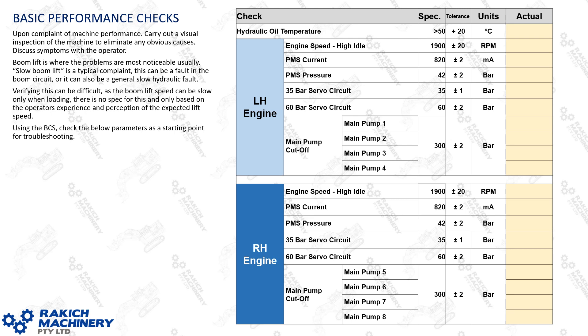After that, have a visual inspection of the machine — make sure nothing's obviously damaged, broken, or leaking that wasn't already picked up by the operator. Following that, test the machine yourself. These are the most basic fundamental tests in this table here. Things like engine speed — it's not a common fault, but certainly something you have to eliminate as a cause when you're first checking.